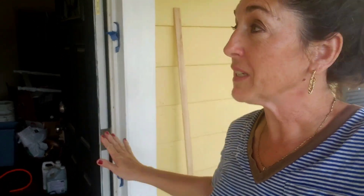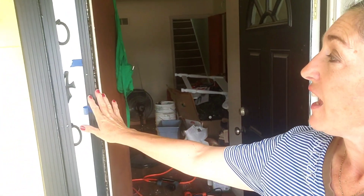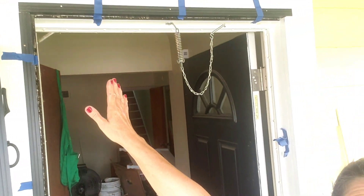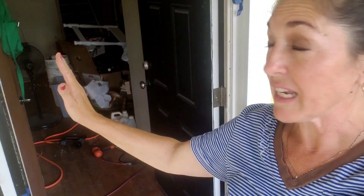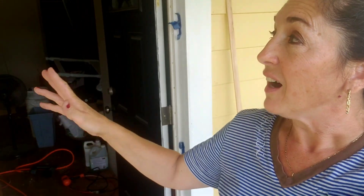I've got some touch-up paint drying. The old hinges did not want to budge and I could not back out the screws at all, so I ended up just grinding off the hinges since they were recessed into the door jamb anyway — you won't even be able to see them with this edge of the door because it overlaps on the side. For mocking up, I keep taping them in place and moving them as needed. This side I've got shimmed up and I may want to reduce or remove a shim. With the last door we found you really do want to have the door hung first, then do your top and other side, because it gives you the right spacing on the closing side.